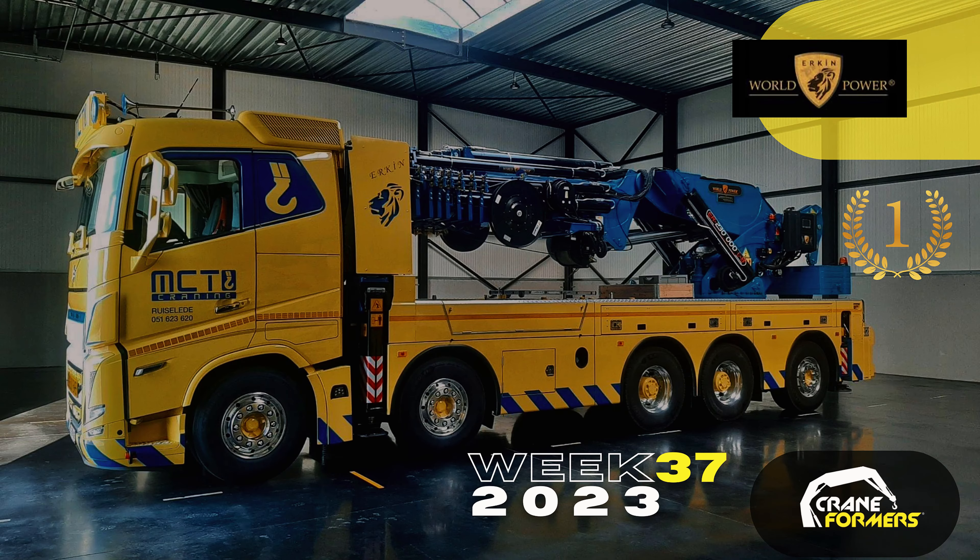On the screen you can see the pressure from the outriggers on the ground. Right now it's at 25 meters. The maximum weight it can lift up close is 39 tons — that's on the back side, close to the crane. You don't even need to extend the rear outriggers or put them on the ground for that lift; they're only there for extra stability if you want.